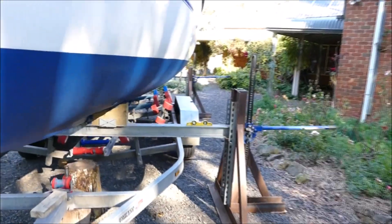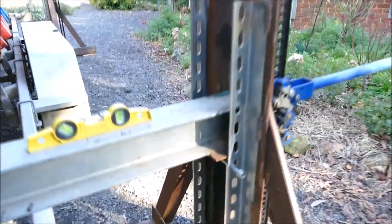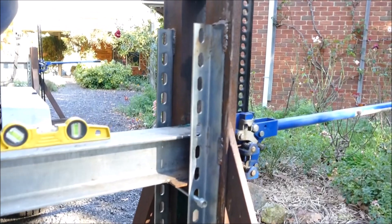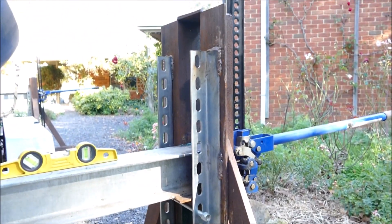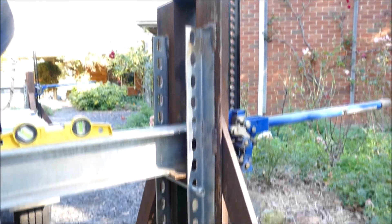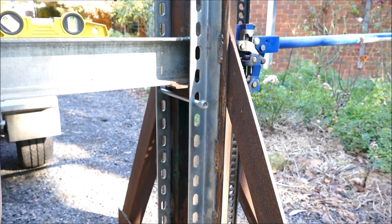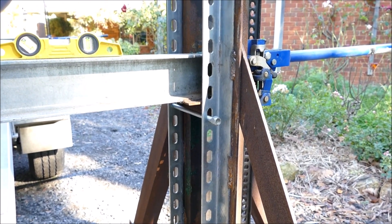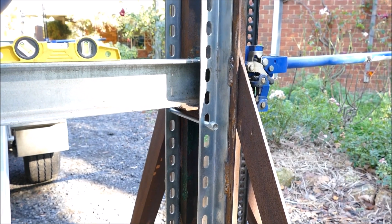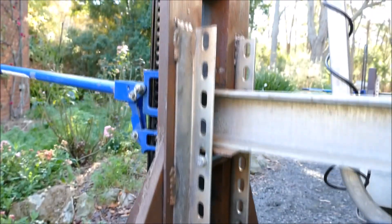I've decided to make some safety backups on each stand. The safety backups are in the form of a slotted angle that's been securely welded onto each of the stands, and allows for a safety pin — which is a high-tensile 14mm bolt — to be put through the slots as you lift the stand, and completely locks the stand together with the support beam, so that nothing can actually come apart at all if the jack was to fail.